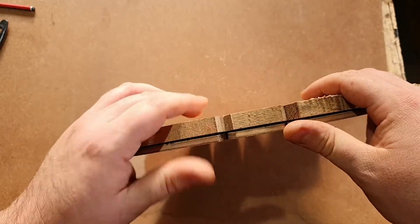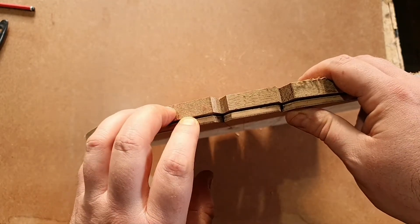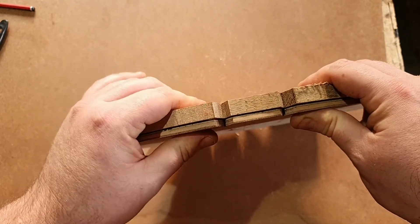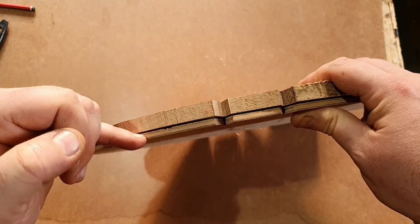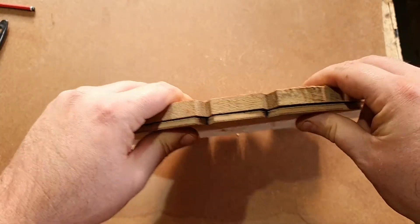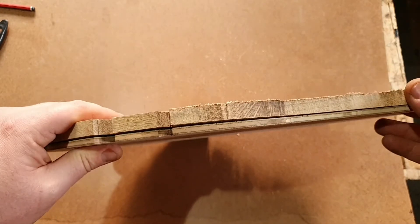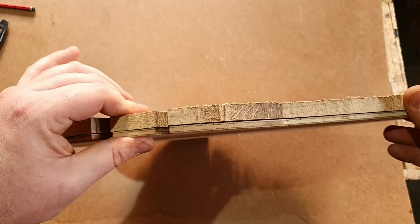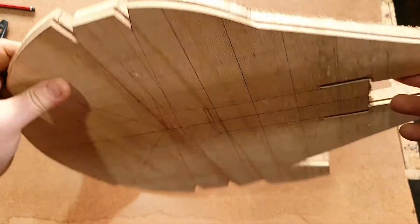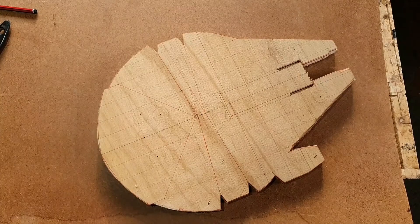You can see it's a bit dicey. I've done this a couple of times where I've used a slightly thinner template and the double-sided tape just hasn't really stuck down that well. What usually happens is the bearing running on it just kind of slips up or slips down and cuts in. So I'll give that a shot first, see how it goes. Take it nice and slow, nice and easy. Might have to clamp up some of these areas on the fly. And then I'll probably take it over to the disc sander and the belt sander.